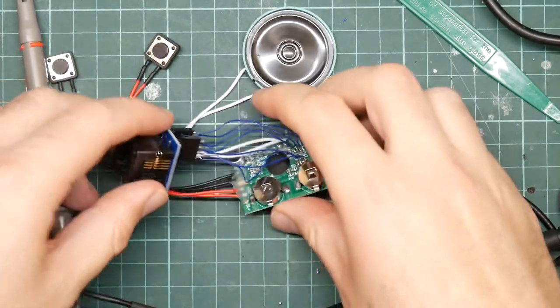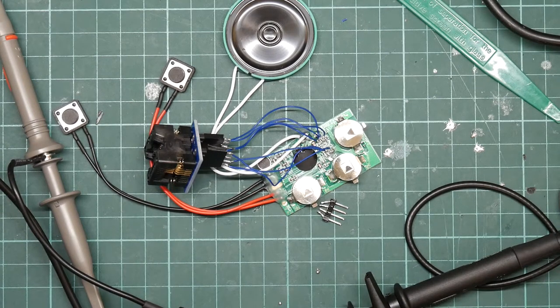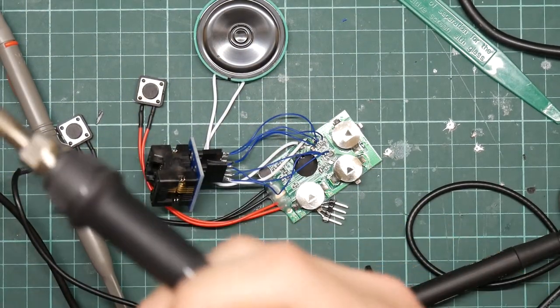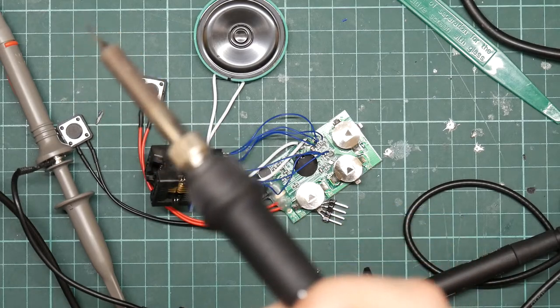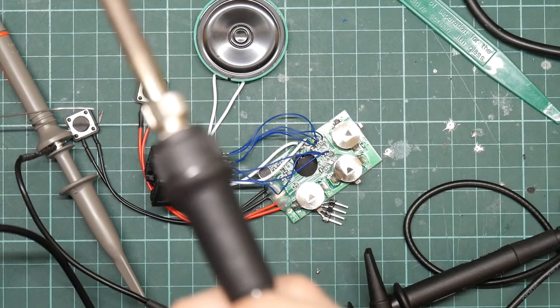Although, now I think of it, remember that pin I didn't hook up? This is hold. It appears to turn everything off on the chip. Now, if that is floating low to make it asserted, then that means the chip will just not be responding, which is what we're seeing here. So, let me just actually try bridging that, just to tie it to power the way it was originally. And let's see what happens. Yeah. Losing stuff all over.